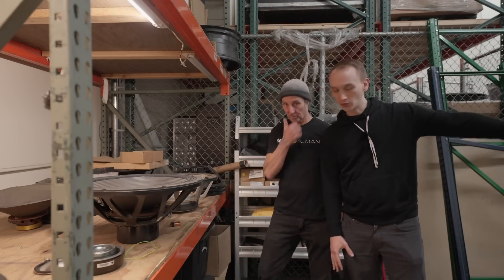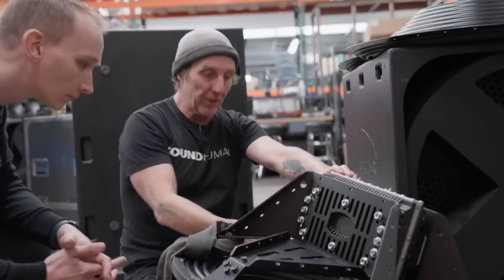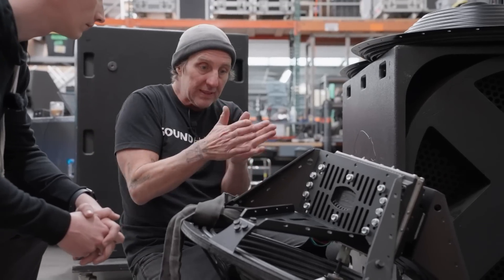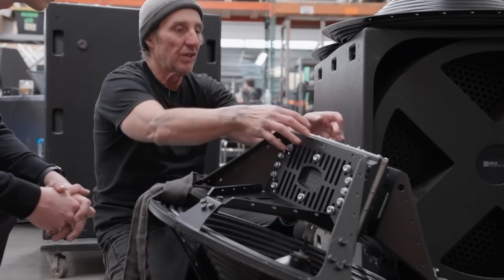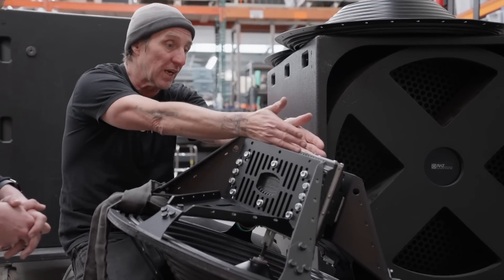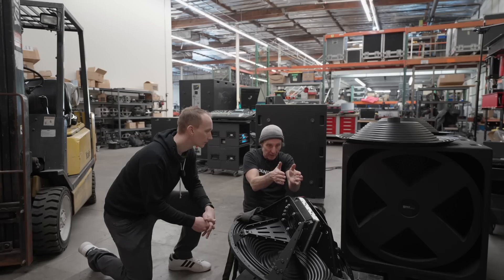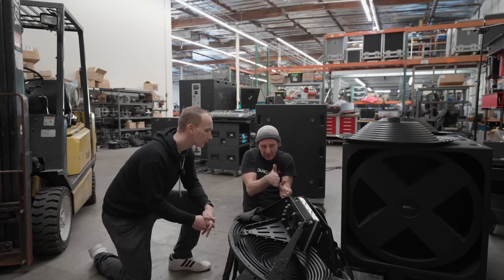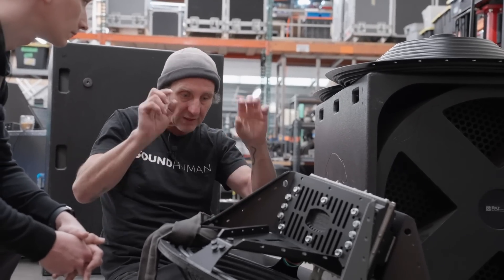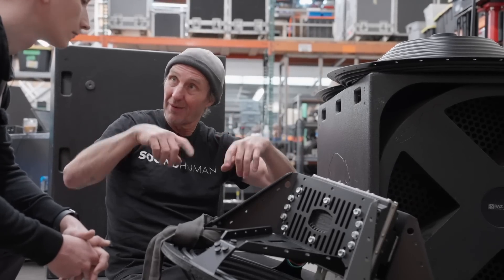So how is this different from what we have going on here in the Supercell? So this is a linear drive motor called an M-Force, and it was designed by Claudio over at PowerSoft. Instead of having a coil of wire immersed in a magnetic field attached to a cone, it's got a flat paddle with four magnets on it. And then these two huge slugs of coils of wire — actually wire wound like a flat wire round and round — immersed and potted into a solid entity in these side plates. This paddle is between those two steel-immersed coils of wire. It's a moving magnet — normally the coil moves. One of the challenges with moving coils is you have to attach electricity to the coil, which means flexible wires attached to it. If you make them too strong, they're heavy and they break. If you make them too thin, they lose a lot of energy and get hot. So you have a lead wire conundrum.